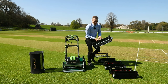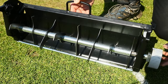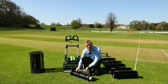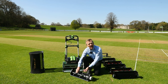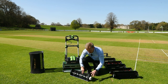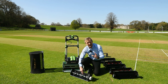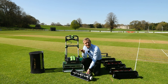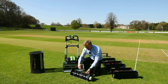Getting continuously more aggressive, the D-Thatcher unit has a wider spacing with hook-shaped rotating blades — much more aggressive. You need to be careful about when you use this because it can really disrupt the soil. Depths reachable with this are around 15 millimetres, but you can set it very quickly, lift it out of the ground, and almost do a verticutting job without having to disturb the soil surface.